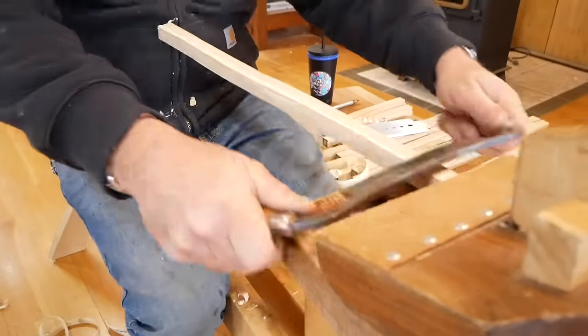A lot of people will leave this seat with carved surfaces. I personally wanted to smooth it out, so I'm using a piece of 10-ounce leather I brought with me — that is a sanding block. If you have 10-ounce leather or heavier, it makes a really nice sanding block. The paper's just wrapped around that, and if you have a nice sanding block it gives you a nice smooth contour. And there we are — we're up to the seat with the legs on it, which was a huge accomplishment. This might be day three.